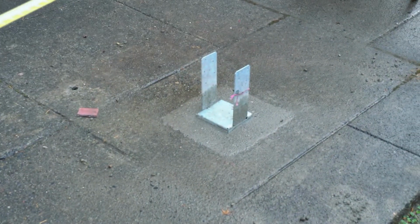So we dug our holes, and then a couple days later we had to call for a footing inspection. And then you have to wait at least 24 hours for them to come out to inspect your holes. That was done. We poured concrete, so all that's finished. So you can kind of see our brackets are in the ground. And they're all set to different locations, just depending on how we need to set our beams. And those are curing real well right now. We could probably start building on them this afternoon if we want to, but we have a lot of house prep to do before we figure out the height of the posts on this deck.